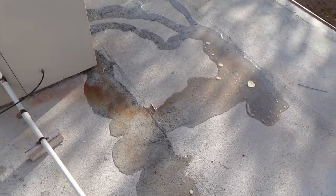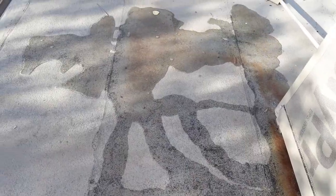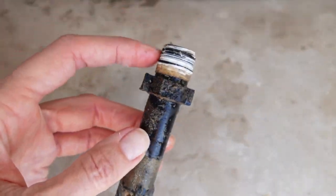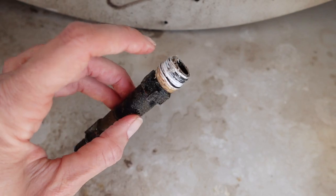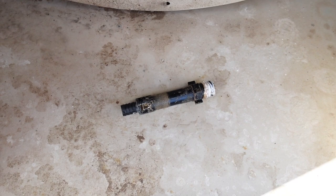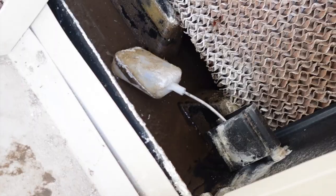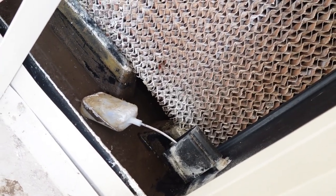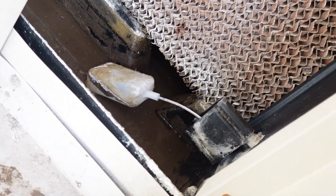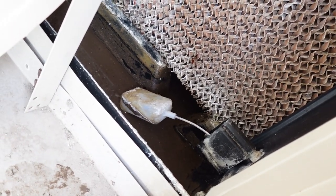I finally found the plug and pulled it out, and all this water is draining out of the water tray, which is good. Here's what the plug looks like — they look different for every unit, but this one is threaded so it screws into the dish. It has a little bit of plumber's tape on it; I just leave this inside the cabinet in the wintertime so it doesn't get lost. The water level has gone down considerably. A lot of people will actually dry that dish out to avoid any kind of mildew growing there, but I'm not going to do that — it's too hard to reach in there.